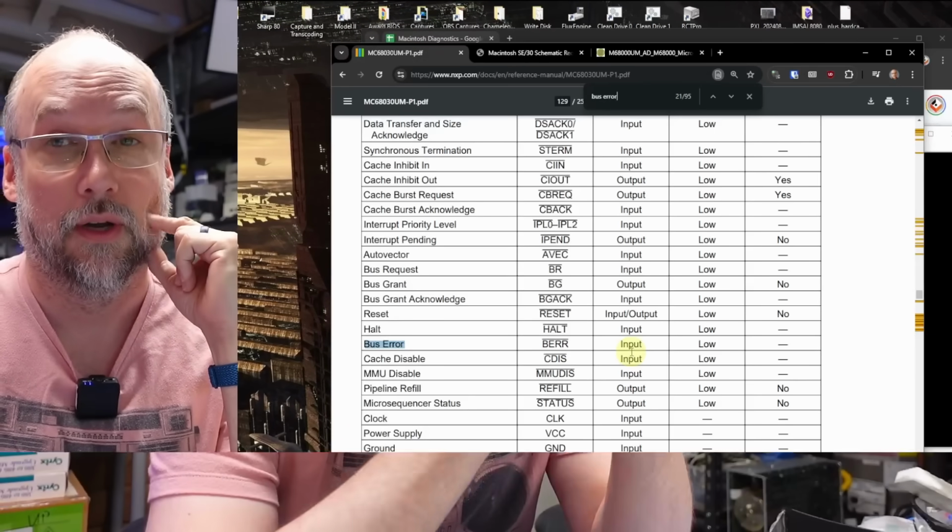As we showed, we're able to store and read back the values from RAM without any issues whatsoever. So I've started thinking about the evidence we've collected so far, and the one thing I keep coming back to is that the bits that say they're working are the top 8 bits, the same ones that are used to communicate from that 32-bit processor to all the 8-bit peripherals on the motherboard, like the VIA chips and the sound chip and stuff like that.